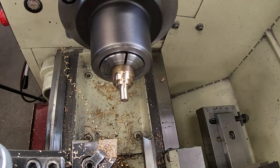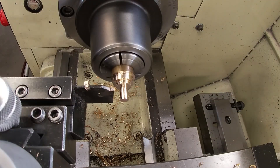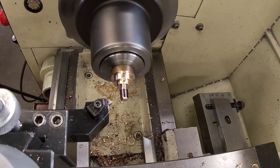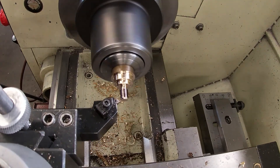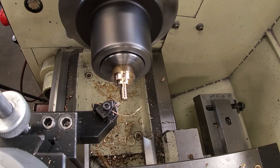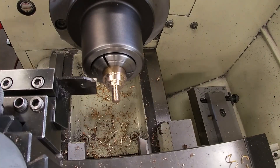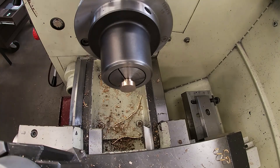I'm taking a couple of light passes — spring cuts — because it's a quarter-inch diameter and the brass was definitely deflecting away. I'm doing my little thread relief, and I'm going to put some 45-degree chamfers on. Always chamfer your threaded section either right before you're done with your thread or before you start. Always check to make sure you have your machine set for the right thread pitch. Threading is pretty straightforward — just hit your marks. I edited out a few passes while checking the thread for proper fit. I didn't really feel like measuring the pitch diameter; I just went by feel on this one. I part it off, face the backside, and chamfer it.